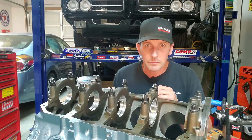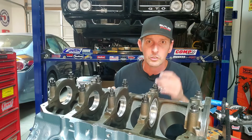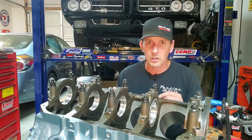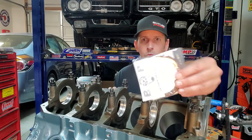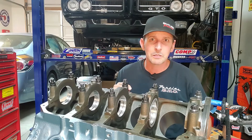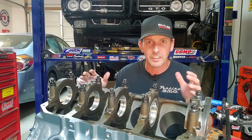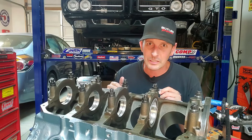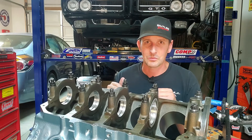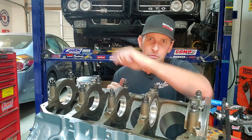I hope you learned something today. Even if you have an LS engine, a Ford, or whatever, you now know what it takes to measure for oil clearance and you can have an educated talk with your engine builder. For those of you that are Pontiac fans, next episode we are going to install a rear main seal that is one piece — we get to replace that rope seal with a modern technology main seal on the crank. We're also going to test fit the crank, and we're going to use some Plastigage to back up our numbers. Thanks for hanging out guys — subscribe if you haven't, and until next time: building fast, driving faster. See ya.